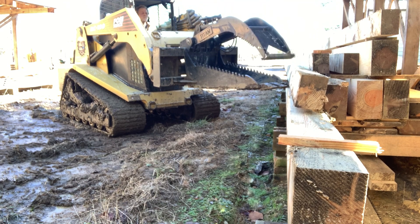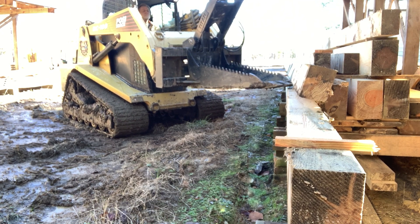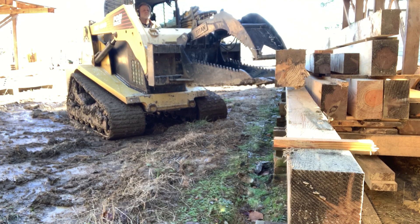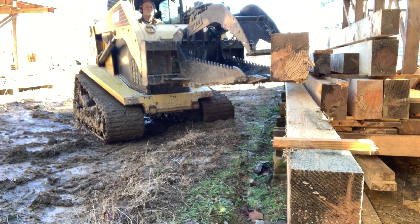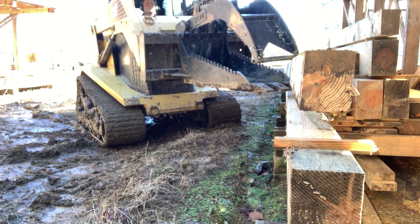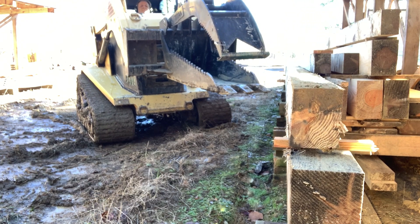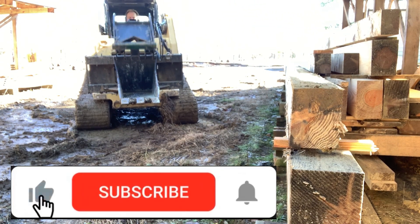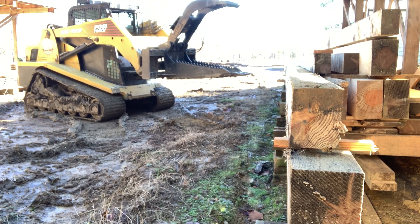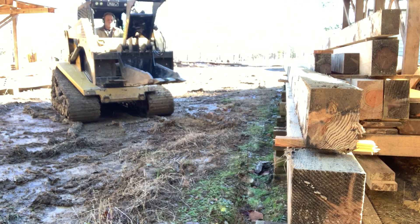What I've decided to do is just do corners — build the corners up as high as I can up to the top of the windows and doors and stop. Move to another corner and get everything down to the cap logs, the plates that I put on. I think that'll be the easiest way. That way I'll get more distance around the building and I can cover these corners up with plastic as I get them done. I appreciate you guys watching today's video. If you like the video give us a thumbs up, maybe subscribe, definitely hit that notification bell so you'll know when we've got other videos coming up. Until next video, you guys take care and be safe out there. Y'all come back now.